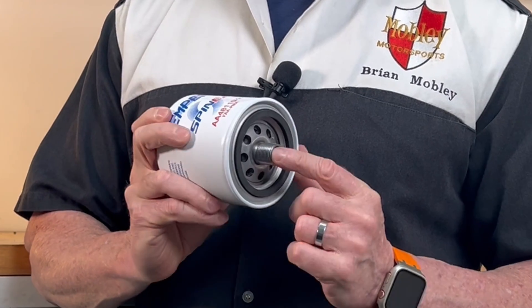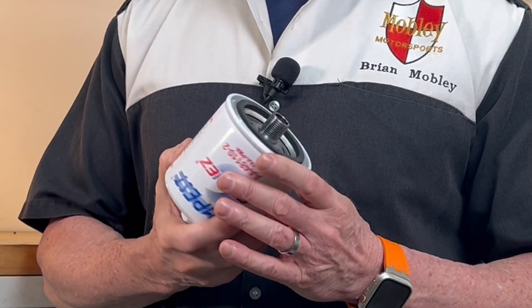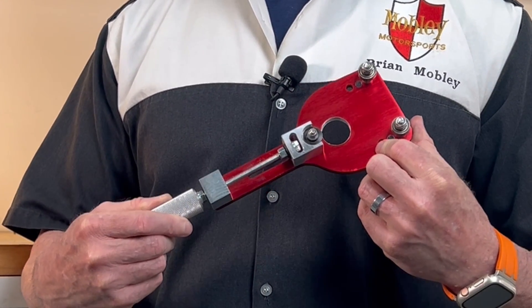So I'm back at my shop. Here I want to go over the process of getting into your filter so you can examine it for metal particles. The first thing is a Lycoming — at least on mine — the accessory housing calls for this filter, which has this male threaded boss at the end protruding out from the bottom of the filter. A little unusual and different than you might find on a car filter. To get into this filter, you're going to need a special cutting tool like this one. I found this one on Amazon and it's relatively inexpensive. However, in order to make it work with that male threaded boss, I had to cut a one-inch diameter hole in the tool. You can also buy this special tool from Tempest, but it's about $150 — significantly more expensive. I'll have links for both in the description box below.